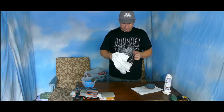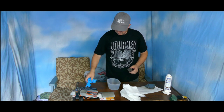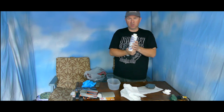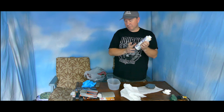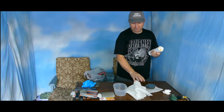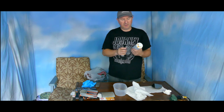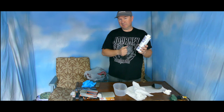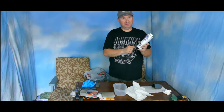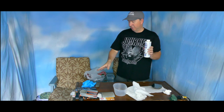The next step to make the etching is going to use ferric chloride — some nasty stuff — so I'll be wearing gloves. I'd wear a mask but it's pretty well ventilated in here; however, you should wear a mask if you're doing a lot of this because the concentration can bother you. There's a skull and crossbones on it — it won't kill you but it doesn't smell very good, so I'll keep my distance.